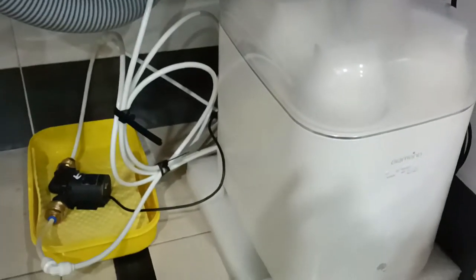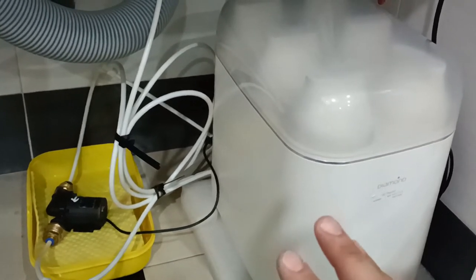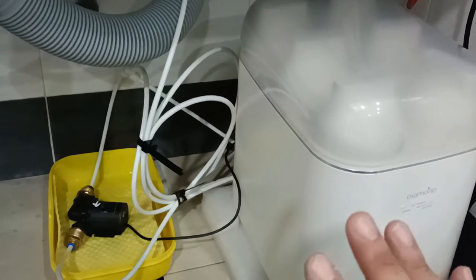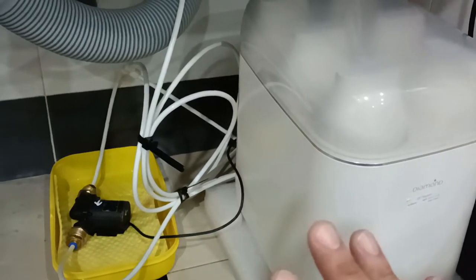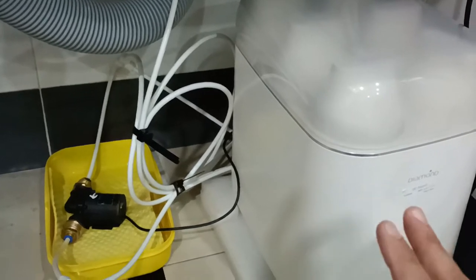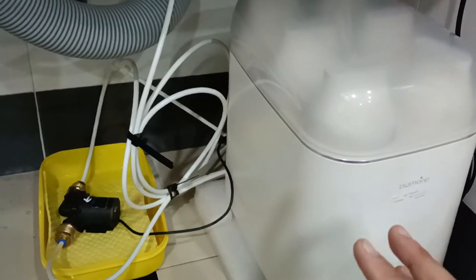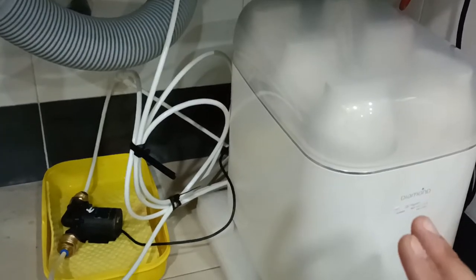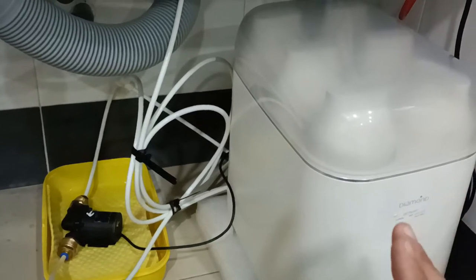So to overcome this, obviously we need to use a booster pump. The placement of the booster pump is very crucial. You may place it outdoors, you may place it indoors and so forth, but remember, different applications, different homes, different ways of fixing the water pump booster. If you fix it outdoors and the pump runs, the tendency to get high pressure is still there, but not too significant, due to the fact that the water still needs to go through a long channel through your water pipe.